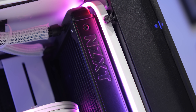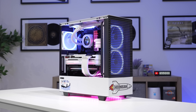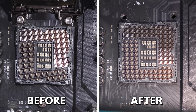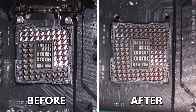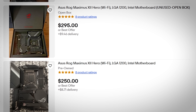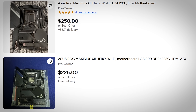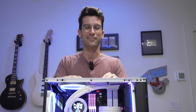I'm pretty surprised that we were able to pull this off given how bad the socket was when it first arrived. You have to be very careful, very precise when using something like a sewing needle on a socket as fine as a modern Intel one. Even older Intel sockets aren't as densely packed, but they are still so fragile — especially with age. Even a slight bump in the wrong direction can snap one or more of these off, and once that happens you've got to replace the entire board. So I was willing to at least give it a shot, and it seems to have paid off. We definitely would have paid a pretty penny for a replacement board like this one — it's very difficult to find Z-series motherboards that are older and in really good condition. Worst case it doesn't hold, he brings the rig back and we replace the board anyway — he'll be taken care of regardless.